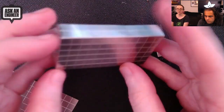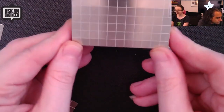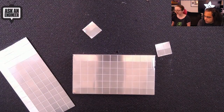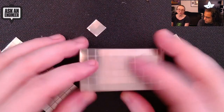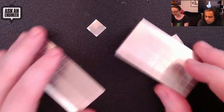So you can use it for enclosures. I think there might be some other uses for it as well. But I've definitely seen this issue where during prototyping, you want to try different shielding. And getting a custom tin, you kind of have to order. They're inexpensive, only like 10 cents, but you have to order like 100,000. What's nice about this is that you just make it, test your design, and then you can order the custom tin based on how big you needed it.